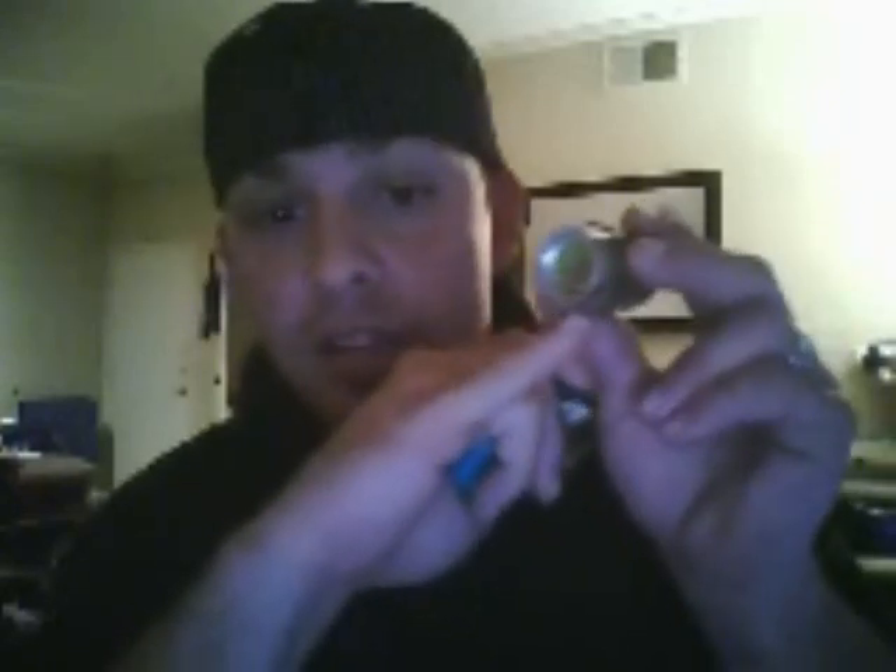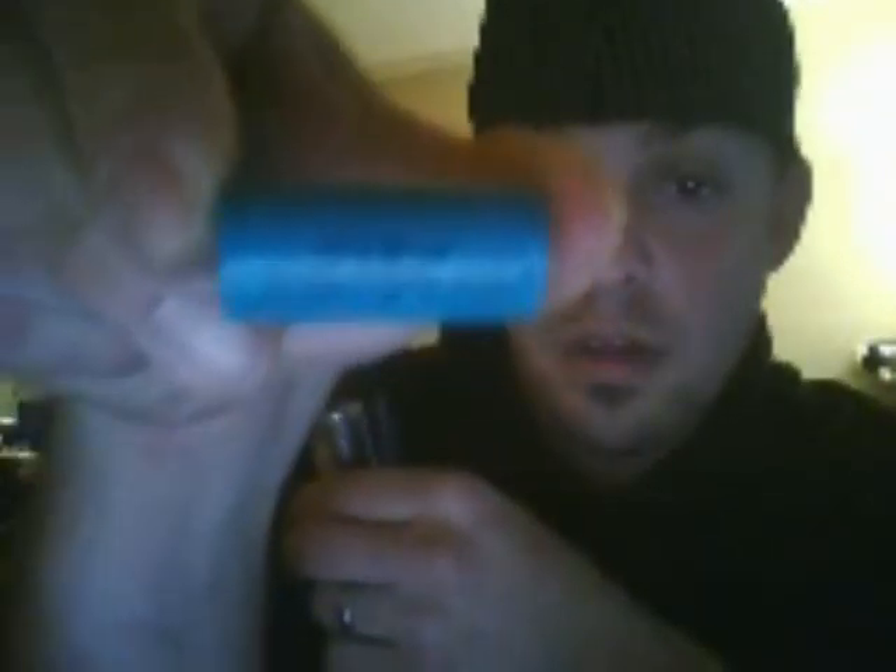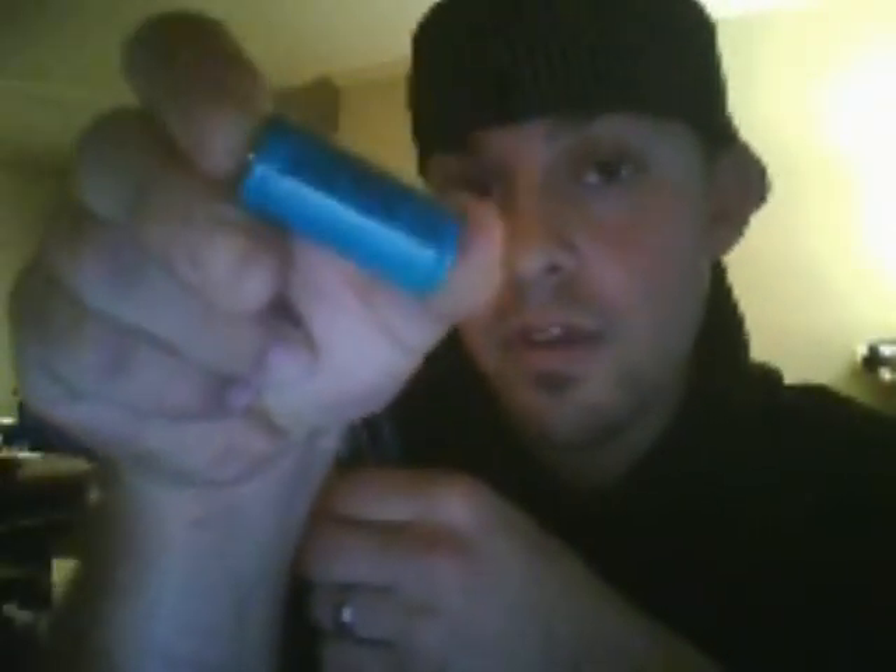You can put a 5-volt regulator in there, you can put a booster in there if you wanted to. But I just wired mine straight — switch to the 510 connection to the battery contact — so I can do 3.7 volts on an 18650, and then have the option of doing 6 volts. I got the 3-volt version of the 16340s so I can stack them and do 6 volts.